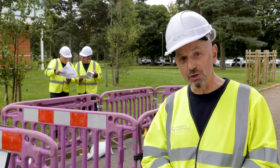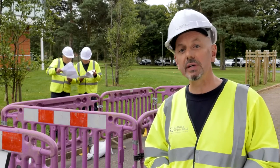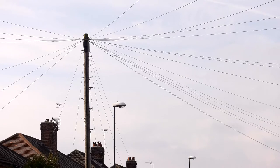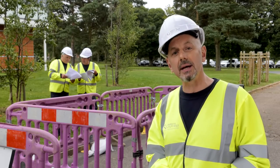You'll have to check and recheck your SSRA and any other permits or documents. Carry out a walk of the area, looking for ground scarring or marking. Check for overhead cables and trees. Check safe dig drawings. Find locations of services. Remember, they're not always accurate. Ensure that everyone is aware of the hazards and signs the SSRA.